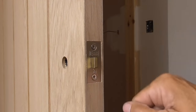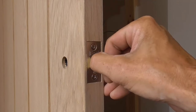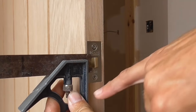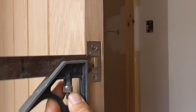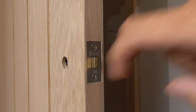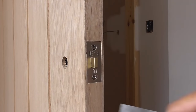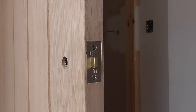What I'm going to do next is find out the distance from the latch to the face of the door, because this will be the same as the distance required from the hole in the keep to the face of the lining. I've set my combination square so the blade is hitting the latch, which gives me the accurate measurement between the face of the door and the face of the latch. Then I'll mark the latch against the lining and use this square to transfer that setback measurement.